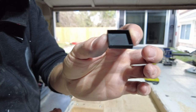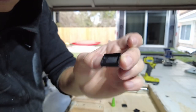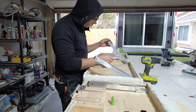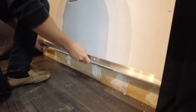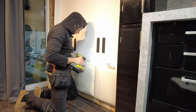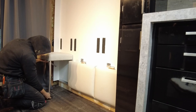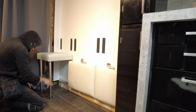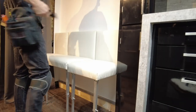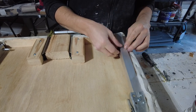Now that we have our wall in place we can fasten our bench seats to the wall and measure the exact length of the leg extensions that we need to create. I 3D printed some feet to go on the ends of these legs to make sure they won't scratch up my nice floors. I'm also installing a piece of aluminum angle at the bottom of the bed frame to help hold up the bench seats when they are in the folded position. With our legs finally complete we can do our first load testing. Everything seemed pretty solid, stable, and sturdy. The only problem was when we opened our bench seats the legs would just come flying out, so I 3D printed some leg clips that hold them in place until we are ready to deploy them.